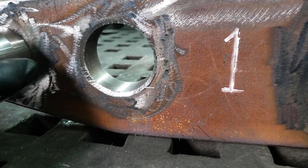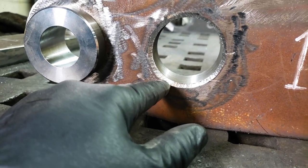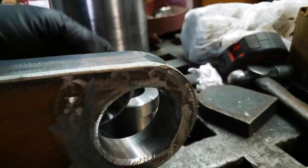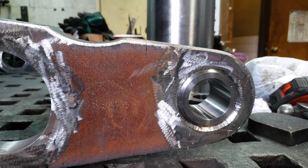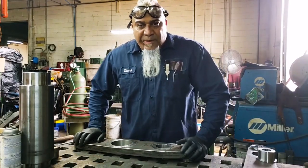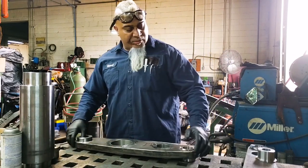So now I can put my bushings in. I'm going to leave this one bushing out because I'll show you when I have to put this on the jig — if I weld this bushing in now, it will not sit properly. So I usually leave that bushing out. I can weld this side in place and this side in place, and then I just got to weld the other one after, which is fine. I like to do this step now while it's on the table because it's way easier. These bushings are 4140, so I've got to do a preheat and then weld.